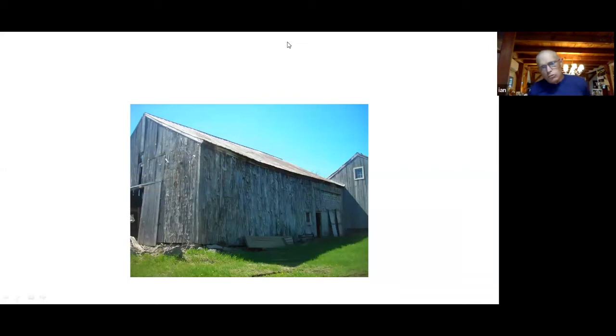This is a ground level Yankee barn at Molten Farms, and you can see a sag in the roof. That's because the foundation, which is a dry laid field stone foundation, has started to fall away underneath one of those side posts, and it's got a bend in it. This barn is in pretty sad shape — the siding looks bad and the roof is an old metal roof.